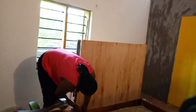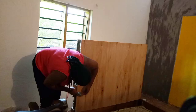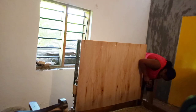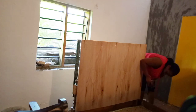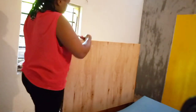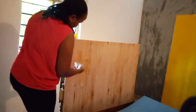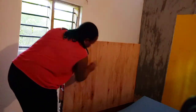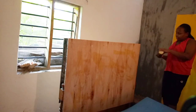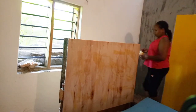What's good team, Forever 20! Hope you're all doing good. So in today's video, as promised, I'm going to show you how I covered this bed. First thing you need is a plywood — a thicker plywood, not the normal thin one. Attach it to the main bed. You can decide to cut the other headboard then fix this one, but I decided to just add this one and a piece of wood at the back to support it. If you can get a bigger piece, you can add it at the side.